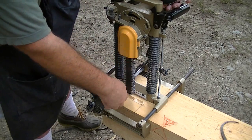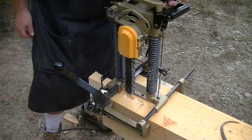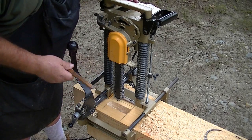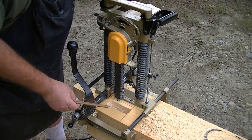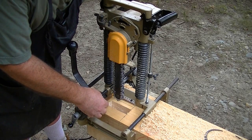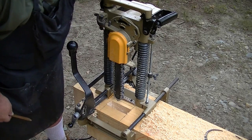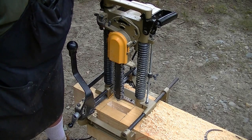Now I know my chain mortiser is going to mortise two inches off of this face. I have my depth set so the bottom of the bar will be beyond the bottom of the mortise. I plunged the first one and the second one, then threw the handle into reverse and plunged two more — four positions total. I then cranked the carriage back until the line I scribed on the yellow tab lines up with the back side of my mortise, and I do a test cut to see if I'm in the right position.